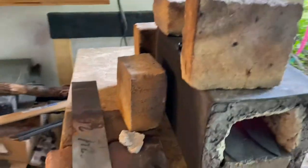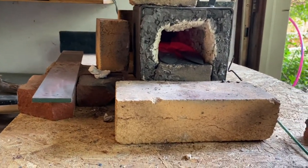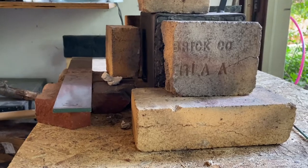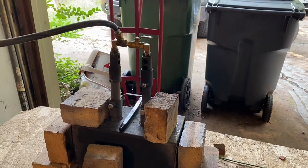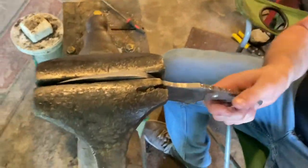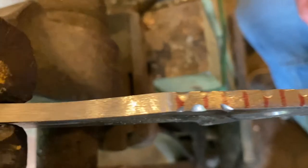Alright so we hit a snag in production. We are currently annealing the two project knives - they're made from W1 round stock which is drill rod, and they're already kind of hardened. Even going through the forging process, it didn't quite work out to where we could drill holes through it. So instead of burning up a bunch of drill bits and saying bad words on camera, we heated them up in the forge, blocked it off, and we're letting it cool down slowly. James is working on a different knife trying to put in a vine pattern.